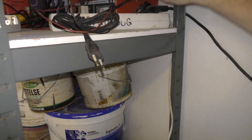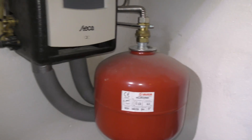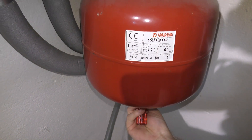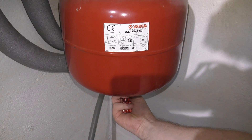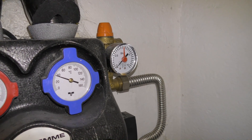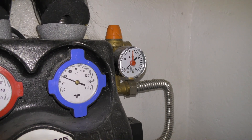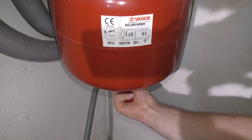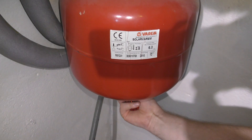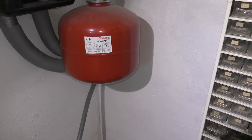Let's turn off the system here, move that out of the way, and detach it. The system is off and I will take the pressure out of it — that makes room for more of the fluid to go in. There wasn't a lot of pressure. That gauge is supposed to show me the pressure in the tank and right now it's not even showing a bar. Almost rid of the pressure here — the water in the system will fall down and I'll be able to take out a little bit more.